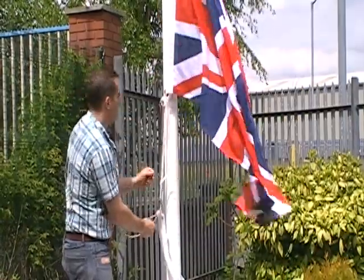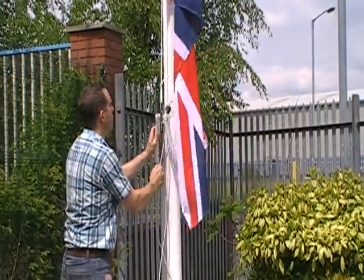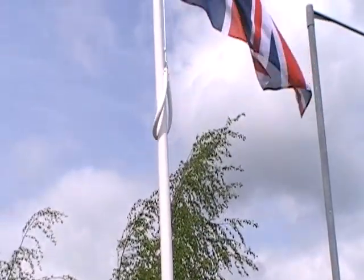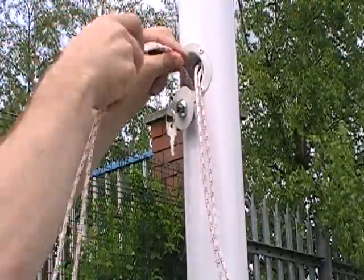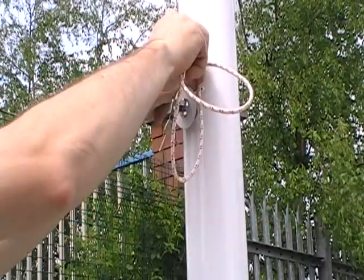You're now ready to hoist. So gently hoist, pulling away on the up-haul which emerges out of the little door on the side of the flagpole, till you get to the top. You'll feel a positive stop as it gets there. Then cleat the rope into the retaining device inside the hatch, and push the remaining rope back down inside the flagpole.